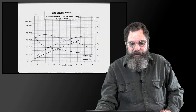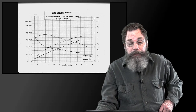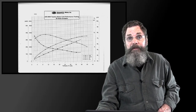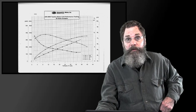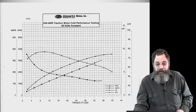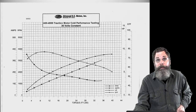There it is. If you can keep the amperage draws down, your horsepower is going to suffer a little bit, but you don't really need it. If you keep the amp draws down and use a lower gear, you're going to be better off. And that's one of the reasons I have not finished testing all that through all the gears, because I just haven't had time with the new cultivating bar. And it's winter now, but the torque, even with a 6 horsepower output in this thing, can be up to over 20. I mean, 20 foot-pounds of torque is a lot for a 6 horsepower motor.